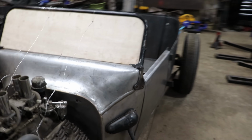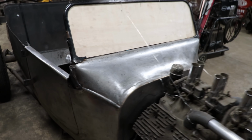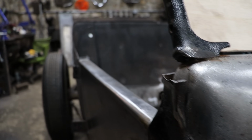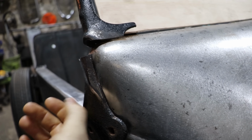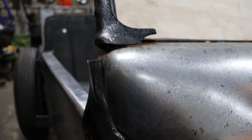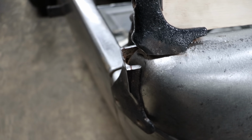Now the other side, when you're dealing with 100 or almost 100-year-old castings, is a little different. This one we've sanded about the same, but look at the gap in there. When we split the casting, I don't know if it came out more or what, but there's not as much meat left in the top. So in here we're really thin, and we really need to cut away where that line is. We need to sand it back.